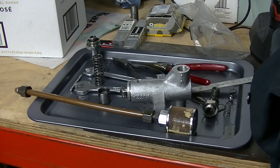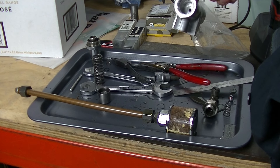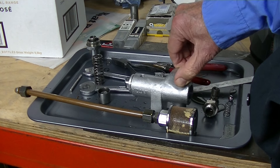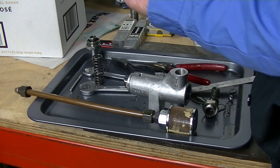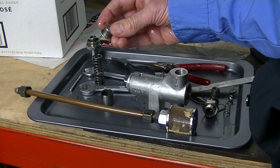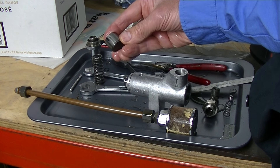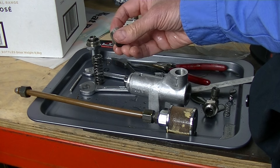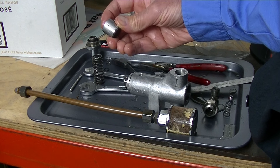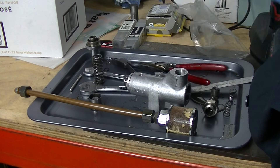I might try and stretch the spring or put a little bit of a spacer behind it. The bore looks reasonable, although the condition of the counter bore down the bottom is pretty ordinary - a lot of chatter as it was originally machined. But I think it'll go back together quite okay. Here's the piston, which contains a little top hat assembly for the spring to sit into. Rough as hell in the machining on this particular part. The only thing I notice with the piston - it's got a little bit of scoring, not enough for me to worry about - but the edges are absolutely razor sharp, both ends. So I'll be stoning those back to make sure it doesn't jam up in the cylinder. That could have been what was happening - it could have been jammed up at one end of the travel. I doubt that very much. I think it's just a case of the spring never doing its job, and when the ball did work it was doing it by accident. Now I've got to fit it up in a way that it'll work reliably.